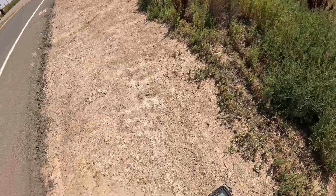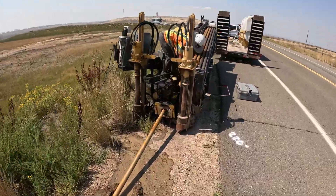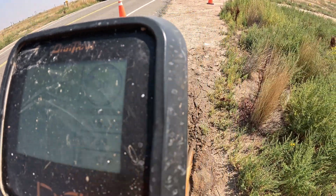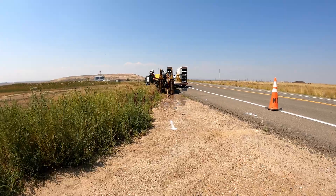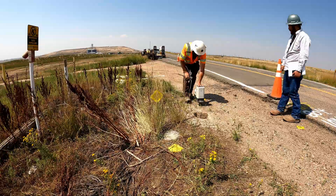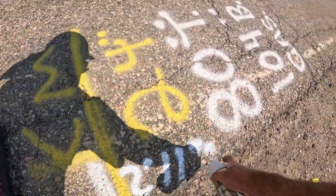Alright, we're in the ground everybody. Let's mark this real quick, and then we've got to steer it a little bit — that's 1 foot 11, or 2 foot. He's going to carve rods 10 and 11 right here. We're pushing 10 and 11 now. You can see the head right here — see that pipe? That's our drill head. We're at 2 foot 11. First gas line crossed.